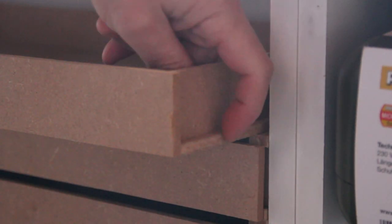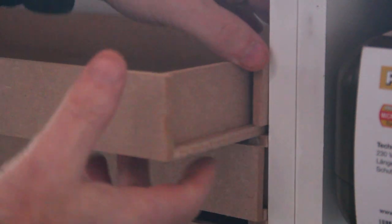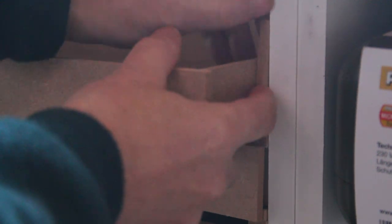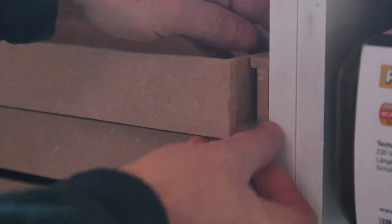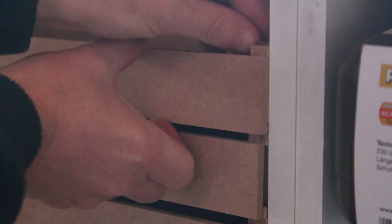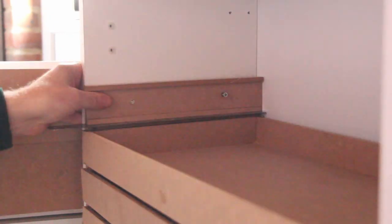My original plan was to use the lip on the sides of these trays along with some strips at the same height as the trays to create a groove in the cabinet that would allow me to move the trays in and out. But because I made these trays six millimeters too narrow, that plan's not going to work because I've got too big a gap. So what I've done instead is created the same slider but with an extra bit on top just to give me the space I need for the trays to fit, and with one of those on both sides I've got enough room so that the trays stay on the rails. It's not the original plan but it'll work okay. I use a thin rule and a scrap to get the distance right and then screw the slider in place on the side of the cabinet.